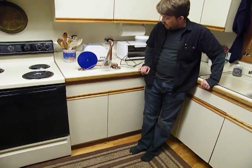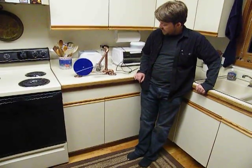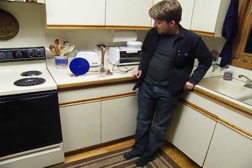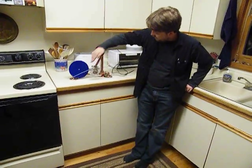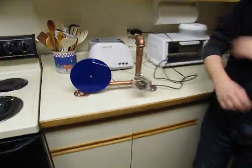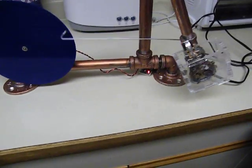This is a fundamental machine that's referred to as a four-bar linkage. So you have this bar, this bar, this one, and this one. The motion of this bar around causes this to move back and forth. There are many different kinds of movement patterns that you can get out of these. We'll do a close-up here. There it is close-up. Note the watch being wound.